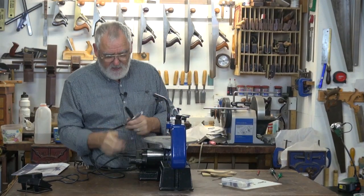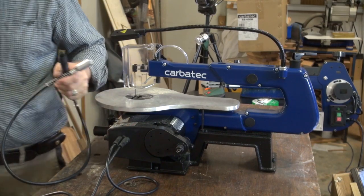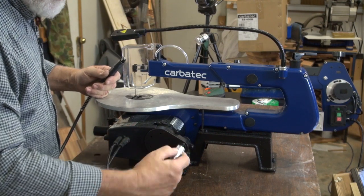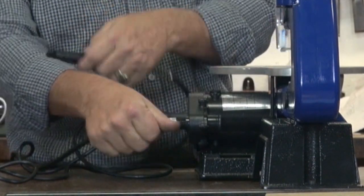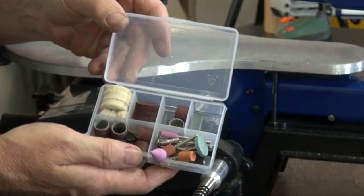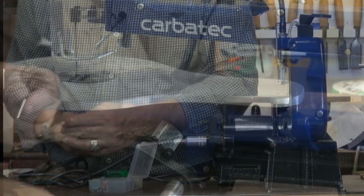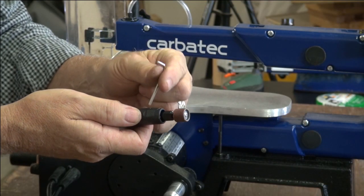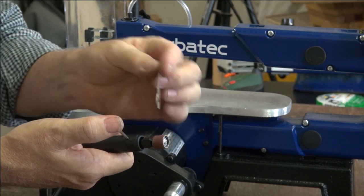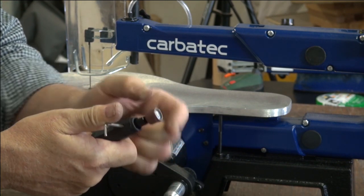Using the rotary tool: get the rotary cable, take off the dust cap and put it somewhere safe, then screw on the housing, making sure that the drive cable is located squarely into the drive dog. Select which tool or bit you want to use. Loosen off the chuck. To tighten, use the right-angled bar — turn the collet until the bar slips in and you'll feel it locate positively, then with the spanner tighten the collet up, and that will hold the sanding sleeve in place.